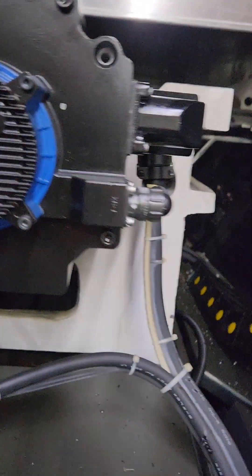Underneath the way itself there's another one just like on the top side — another Gibb. So you've got three screws on the tail stock end that push the Gibb in, and three screws on the other end. Loosen those three screws on the spindle end — I usually go a full turn — because if they're really loose you might think you've got the Gibb tight when you're just tightening against the screw. When you come back to the tail stock end and that screw is tight, you know you're up against the screw on the other end. Loosen enough, then snug these up. On the Z-axis I don't back them off, I just snug them, then tighten the screw that traps the Gibb from the other end.